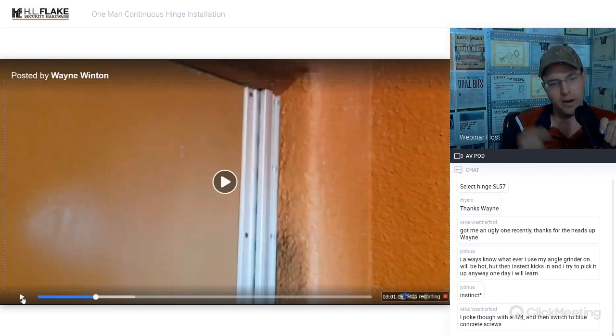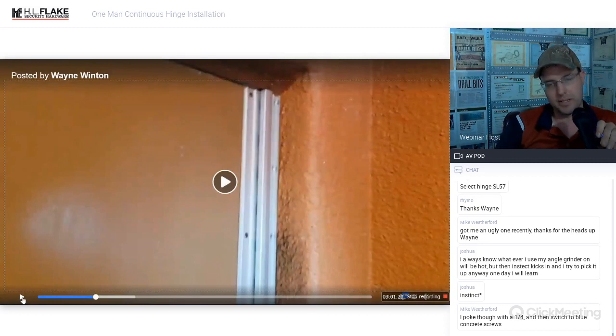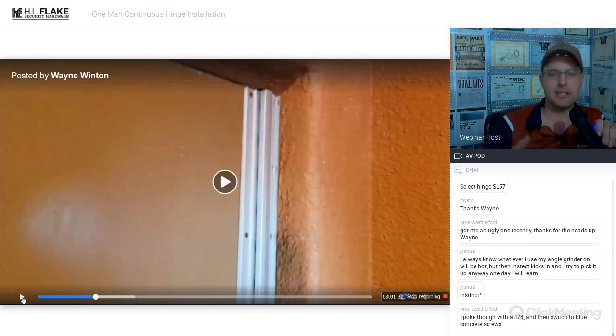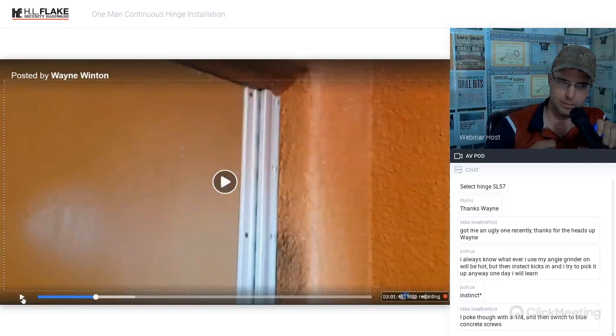You're never going to just rip a screw out just because of the vibration and impact. However, if you put a screw in the concrete and you're relying on the threaded concrete of, let's say, a Tapcon that goes into the concrete itself, and you're not relying on the metal-to-metal contact, that door over time could possibly fail. Those screws could fail because the concrete is brittle. Every time that door slams, every time it expands and contracts, you're losing friction when you do that. So I've had success with it. I've also had it completely fail. I found that using the metal and using the method that I'm showing right now is normally the preferred way to do it, so it lasts longer.